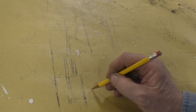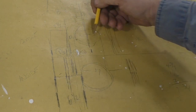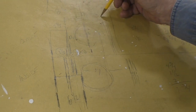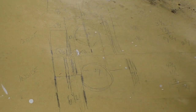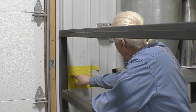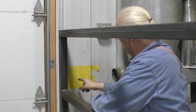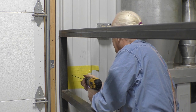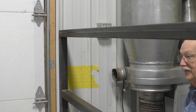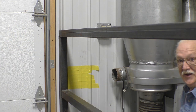Unfortunately, that puts this hole right up against the railing — it's going to be a tight fit. I'm going to try to sneak it just a little bit off center, but the duct is actually seven inches, so it's kind of forced me to put it right dead center in that panel. After careful measurement, I believe if I drill right there it will come out in the center of the two ribs on the outside — remember, this rib is not lined up with the outside. It's got insulation wrapped around it. And it's dead on — I would say dead on.